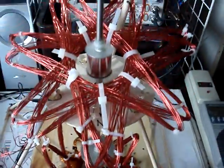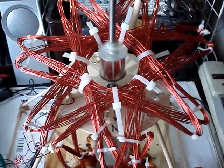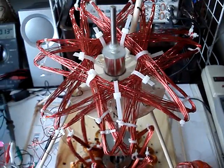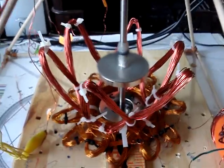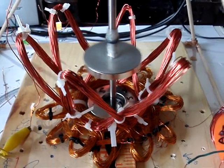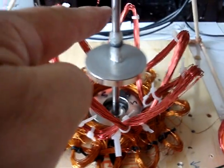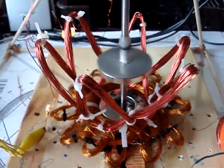It also has some secondary coils. The main drive coil in series is the star coil — a seven-point star coil. I'm experimenting with the Bloch wall effects and also the Faraday homopolar generator, where there is some voltage produced from the shaft over to the edge of the rotating disc magnet.